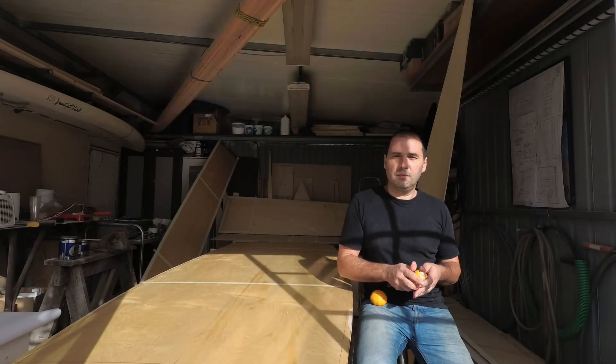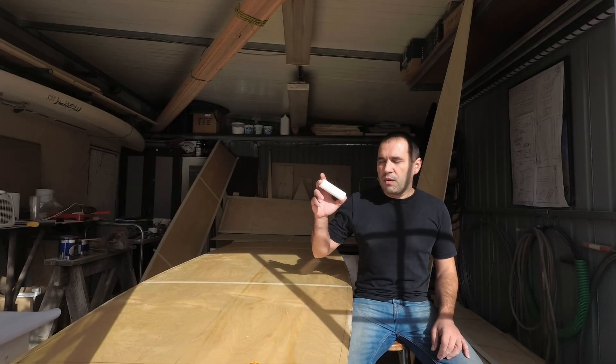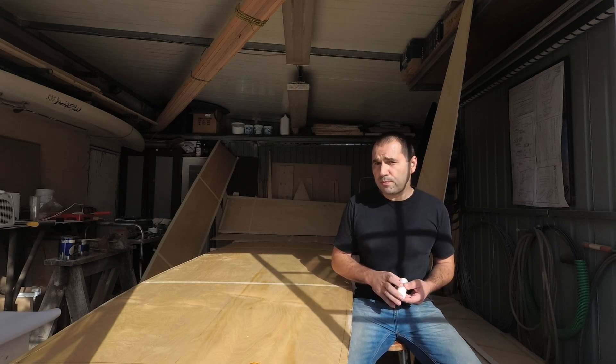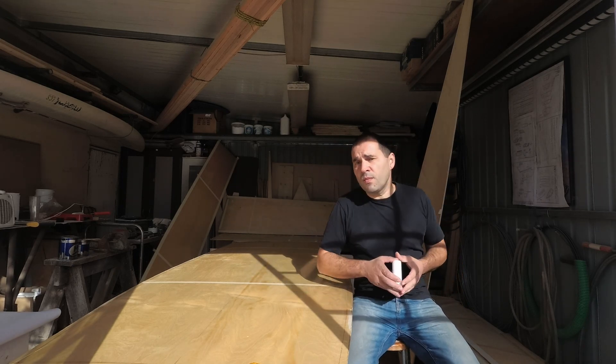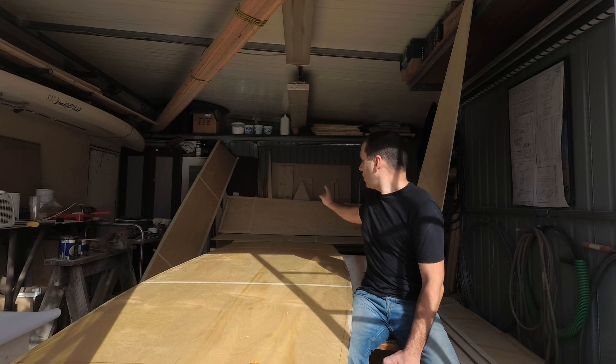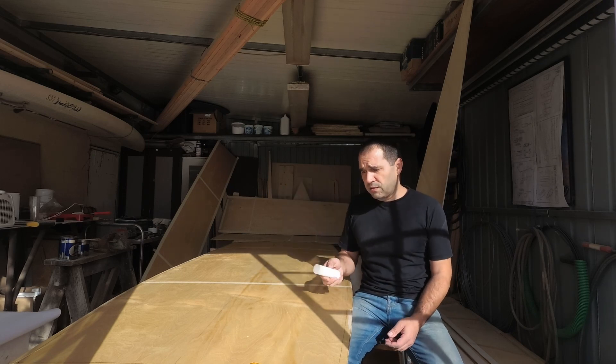One more day, just coating panels. The weather looks rubbish today — I'm going to try and do all six panels inside this little workshop. For the bottom panels, I mixed 180 grams of epoxy — that's for two panels. For the bigger side panels, 130 grams. And for the smaller panels, 120. There's enough epoxy there to wet the roller when you start, in any case.